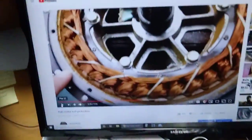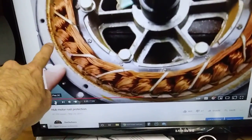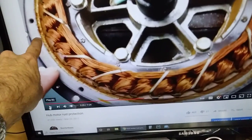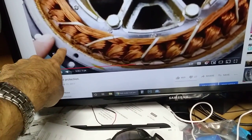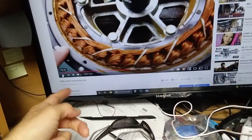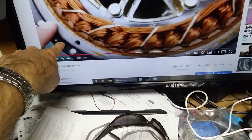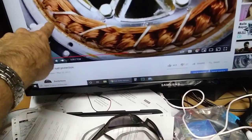This is one of the videos on my YouTube channel where I repaired a hub motor for a friend. What you can see is all the rust on the magnets that are on the rotor parts. Those magnets were spinning inside the motor because they were unstuck. My friend was twisting the throttle, he heard a motor spinning, but the wheel was not spinning — the magnets were spinning inside but not the rotor part. So the magnets were un-glued.